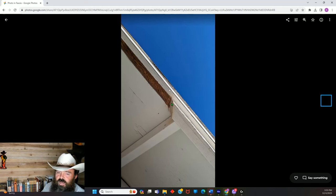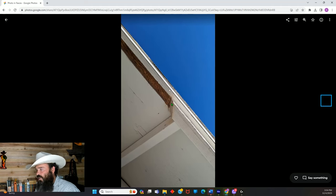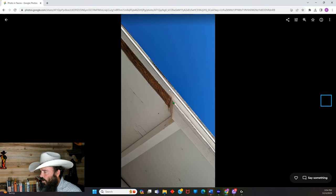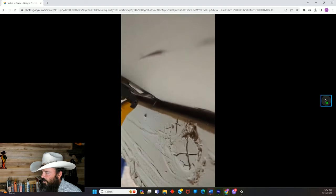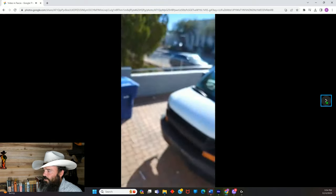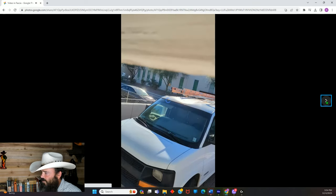This is a freehand 45. This is an exterior component — it's fascia, not finished carpentry. This is exterior framing, essentially. So although it's a very good cut, it's not perfect, but that's freehanded with a multi-tool. You can also see me cutting off more of these nails that come from the roof down into the fascia, and we do the same thing from the side — getting at the rafter nails from the side.